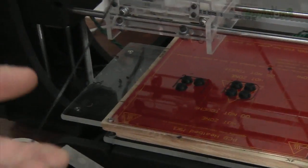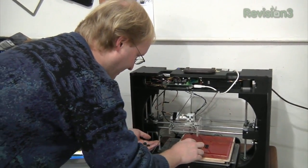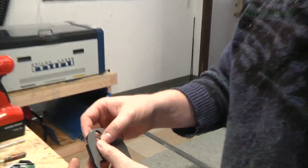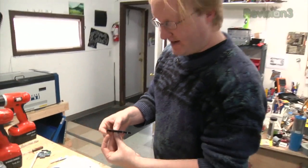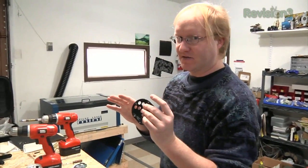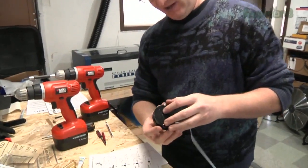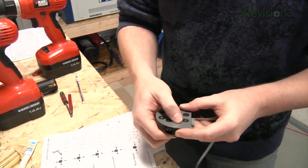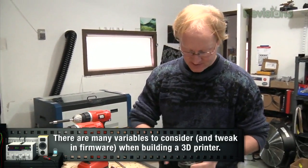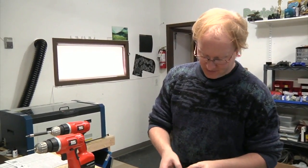Take these buns out of the oven. Got to let the heating surface cool down a little bit, because if you remove them too soon they'll deform. The buttons don't quite fit through — I think that's because the machine still needs a little bit of calibrating. It prints things slightly too large, which means I have to change the number of steps in the X and Y motors. But for now I'll just cheat these down a little smaller so they'll fit. The advantage of 3D printing is we can iterate, but this is a problem with it — it's not always as consistent as you might need. Some of these don't quite click all the way because of varying distances. So I think I'll actually laser some disks instead — that way I can have a thinner back to them.